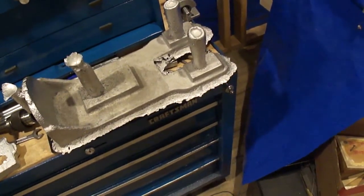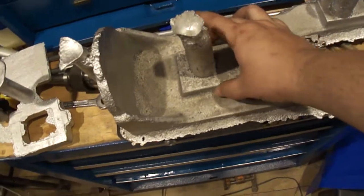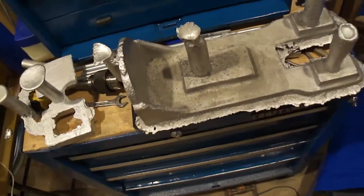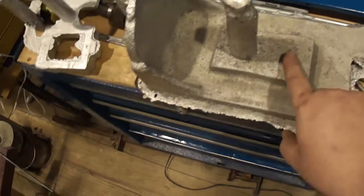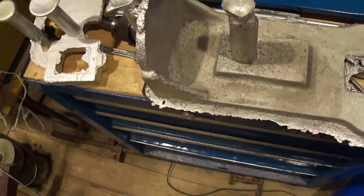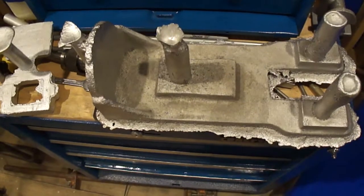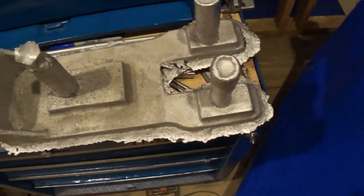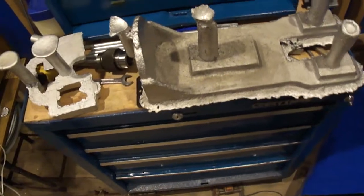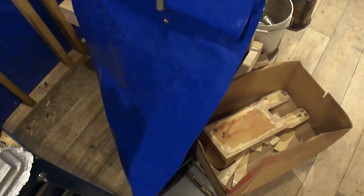The whole bottom is five-eighths inch thick. It shrunk here for some reason — shrunk like a bottleneck this way, and also shrunk just a little tiny bit right here. But I'm going to machine that down and put a steel platform on it and create grooves in it for babbit. I had a little bit of sand wash here that I knew about — I just couldn't get this pattern to mold. Everything I tried failed on me.